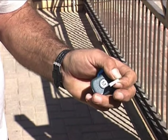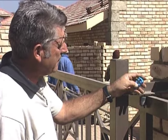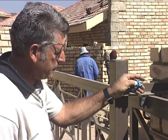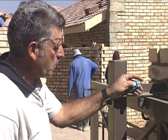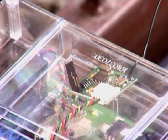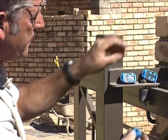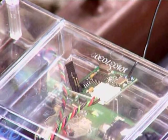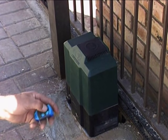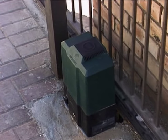To add any additional transmitters, press and hold any button on the master transmitter for slightly longer than 10 seconds. As an installation hint, if you don't have a watch available, count each second aloud from 1000 — for example, 1001, 1002, up to 1011 — then release the button. The receiver is now in program mode and will stay in this mode for 10 seconds. Take the next transmitter and — this is important — press and release the button you want to use to operate the gate. The receiver stays in program mode for 10 seconds after each new transmitter is added. If you have no further transmitters to add, wait 10 seconds for the receiver to drop out of program mode. Test the transmitters to make sure that the coding has been done successfully.